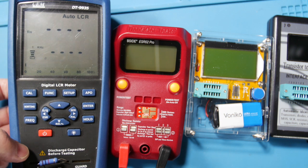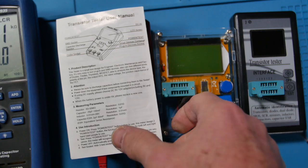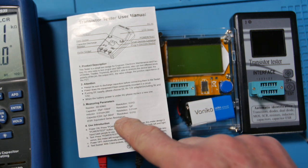How about a simple resistor — brown, black, red, so 1k ohm. The drop tester reads 995.5. The kit meter reads 989. The next meter reads 995.9. And the CEM reads 992.8. All four meters are very close on resistor measurement.